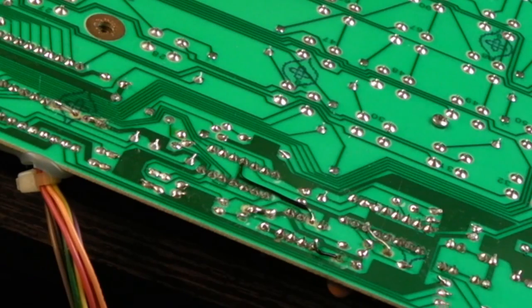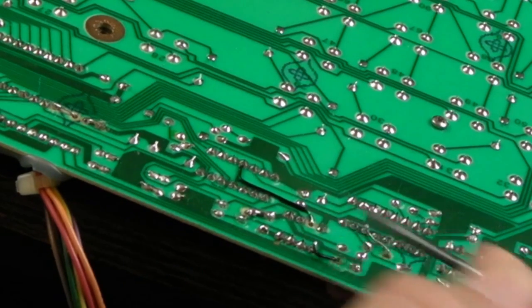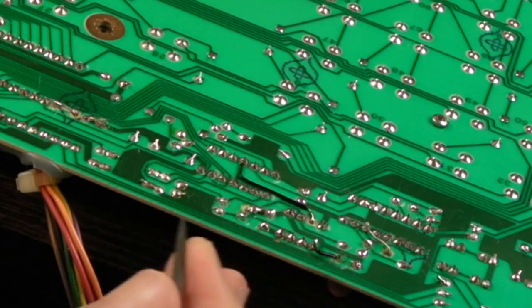Right, so I'll just summarise what I've done. Obviously I've replaced or extended that wire there, all the way to there, and tidied up its solder point. Replaced the wire here. It's slightly curled, but it's wrapped around the pin and it's joined up there carefully. This is a leg from a cap or resistor or something on the other side, so yeah, that's okay. I've just straightened it out though, reflowed it on both sides. Trimmed off any of these little excess bits here.